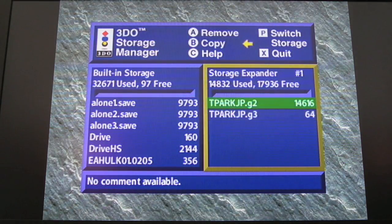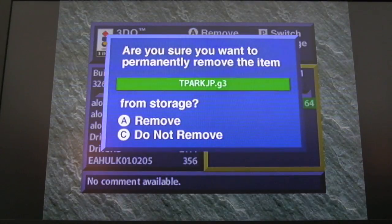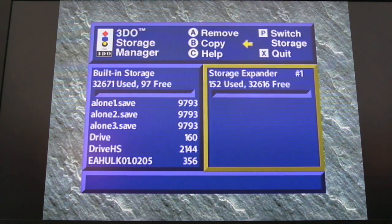And I had to burn at single speed, by the way. It's just been that long since I've burnt a disc for a 3DO, I couldn't remember. But yeah, the initial ones I burnt weren't reading very well. Burnt at single speed is fine. So we're back to the whole burn speed makes a huge difference on some of these old systems. I'm just using Maxell discs here, or Sony discs. They read fine. They just need to be burnt at single speed.